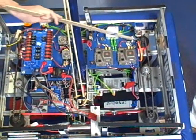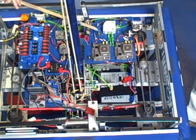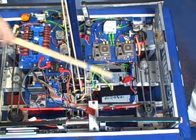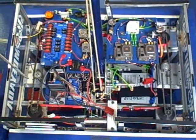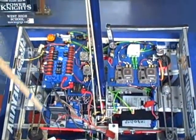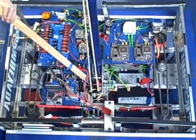From there, we run this orange cable underneath and split into our solenoids, splitting the working pressure into our solenoids. From there, we power a couple of different pneumatic cylinders. We have one on each one of these gearboxes to shift, a cylinder here and underneath here which turns our wheels, and a cylinder here which acts as a brake on our winch mechanism.